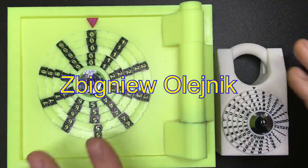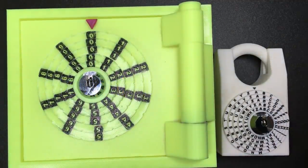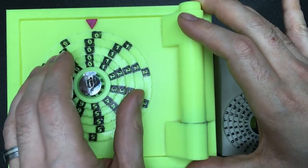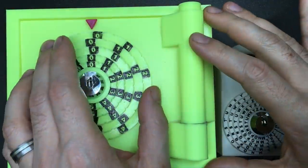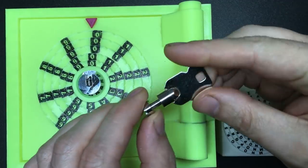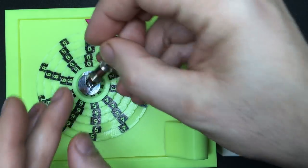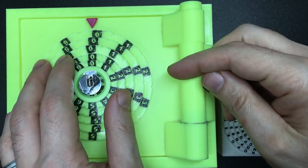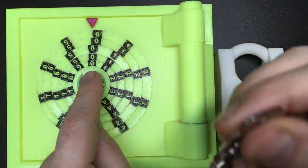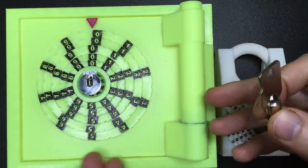I think it's Big Knife, and he let me borrow these two locks to just explore. I've already had a go at trying to manipulate these and I have to say I can't get anywhere with it. Essentially, you need to unblock the wheels first by using a key turning anti-clockwise twice, then that unblocks the wheels. Only when you've unblocked the wheels can you attempt a code, and then you need the key again to drop the actuator arm down into the gates, which are either false or true.